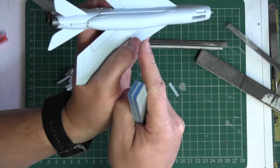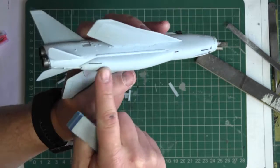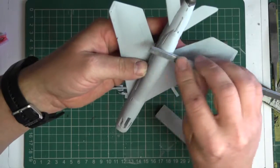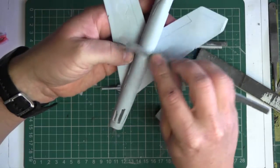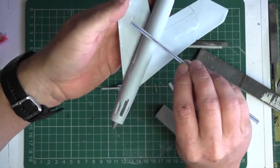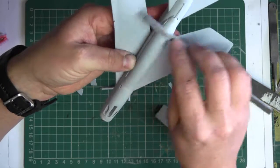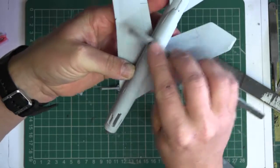It's good just to angle it in the light to see where you need to go. It's not perfect, so we'll just come in and do it a bit more. So coming in with the rougher grit. These are flooring models. This is the blue sander. So there's a medium grit and a light grit on here. So we come in with a medium grit, and then we go over with the lighter grit.